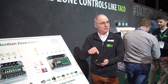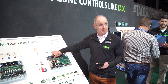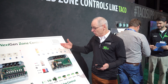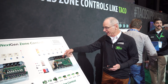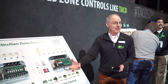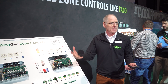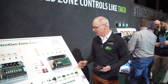Through the mobile app, I can change the functionality of both boiler end switches and three different aux outputs. With that micro zone, I could either not fire the boiler, or I could turn on another zone at the same time to give more load every time it calls. So zone 3 can still call independently, but when it does, it may turn on the radiant floor in the basement — whatever heat I want to go to — giving it the ability to absorb that heat.